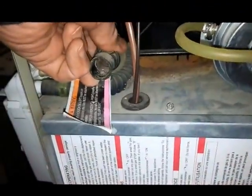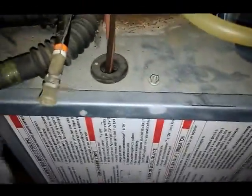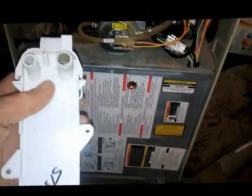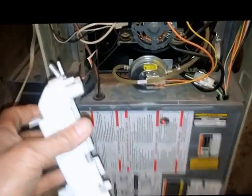When you pull that off, pull it right to the front. There are clamps on there that you'll have to loosen — hold your bucket right there while the water drains out. Pull off your other tubing and get that trap off. A lot of times it's mounted through the deck of the furnace, so you have to take off the lower door as well. Once you've got it off and it's full of water, take it to a sink, fill it up several times with hot water, slosh it around, clean it out real good, and put it back together. That's a very common problem with this furnace.